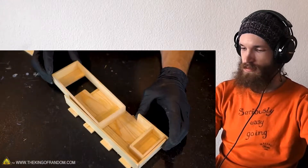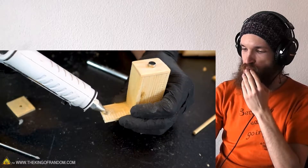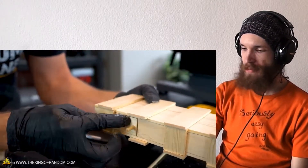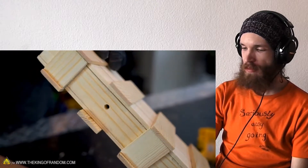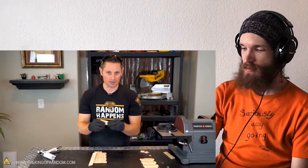Peel it off the paper — the box will move freely. With a small compartment, I add some hot glue and push the dowel in to prevent the large drawer from pulling out until the small one is removed first. The wider fit actually helps a little bit; if it's a little loose, sand it down so you have the right width.